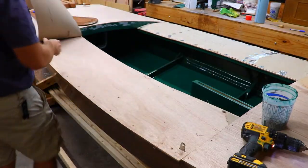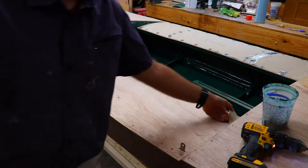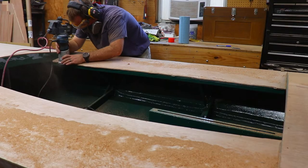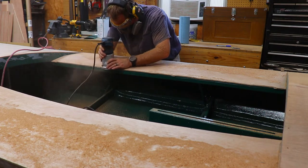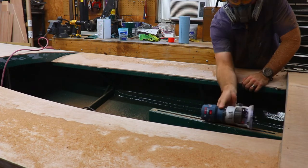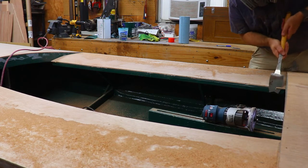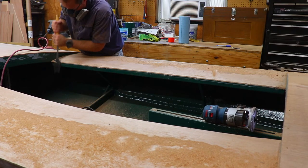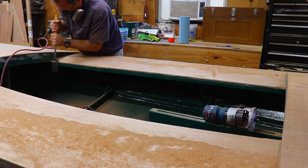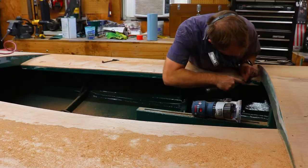After removing the screws and cardboard, now I can trim the quarter decks or seats down to their final dimensions. I used a router with a round over bit to remove most of the waste on the inside of the cockpit. Due to the curvature of the seats it didn't work perfectly, but it saved me a lot of work. I also used a flush trim saw to remove the corner pieces where the router couldn't get to. I then used a hand plane to do the final trimming to make sure that the edges of the seat panels were flush with the rails on the seats.